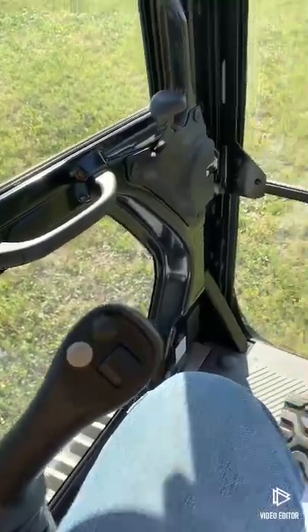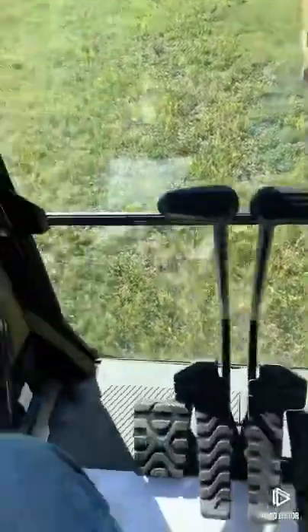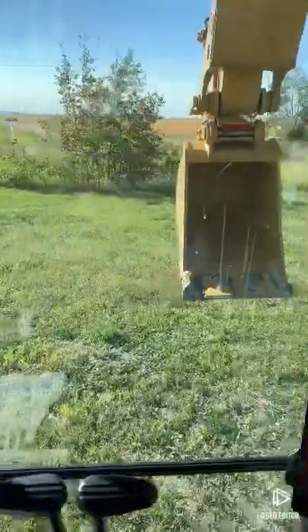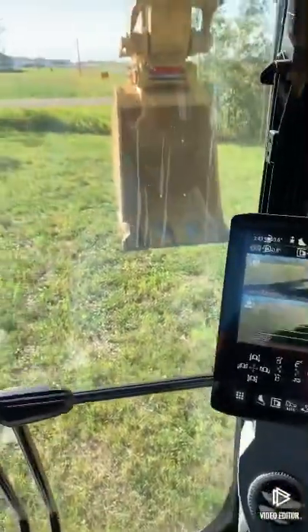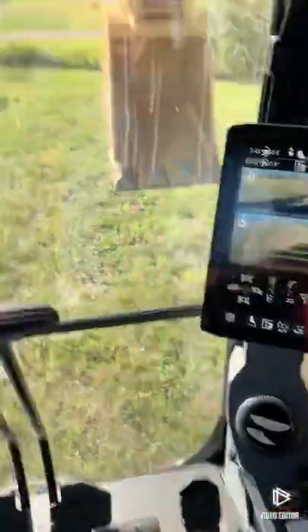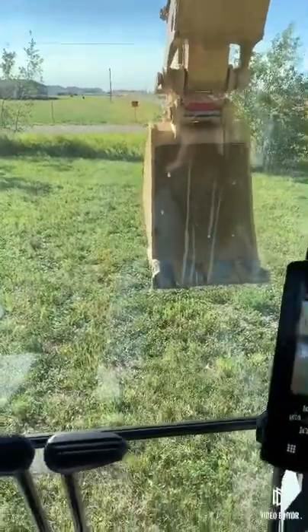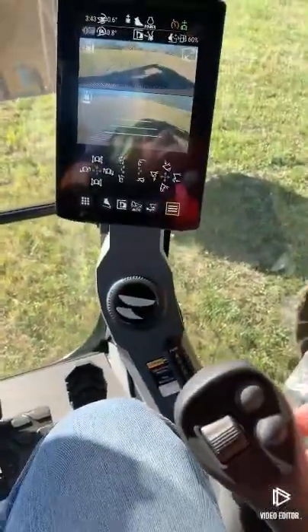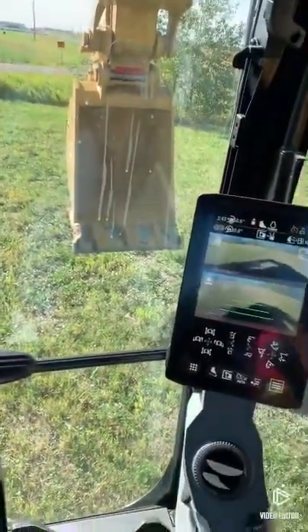That's all of your steering controls — all run from the left-hand joystick. On the fly, if you need to run any hydraulic functions, CAT has you covered. To swing the house on the left-hand joystick, use the little roller knob — run it forward or backwards to swing your house while in joystick steer mode. If you need to run your stick, the rolling knob on the right-hand joystick gives you stick function while in stick steer mode. Bucket control stays the same as always, and boom up and down is on the right-hand joystick.